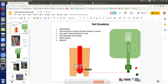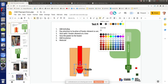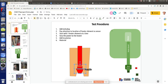One issue you've got with this is that the last bottom part is tapering off significantly. So the circumference is smaller than the heating elements are made for. So I'm wondering, is there a filler material that conducts really well? Aluminum foil? Thermal paste? Aluminum is a great conductor, it's a metal. So you want to wrap that around it so that the band heater goes right on top of it. Yeah, probably.